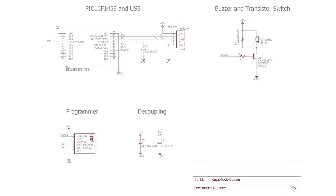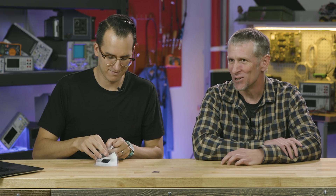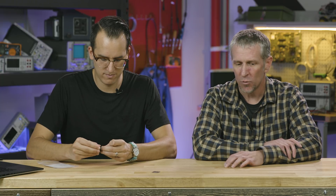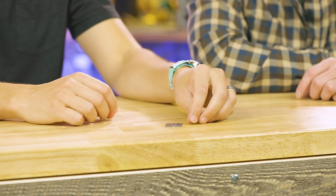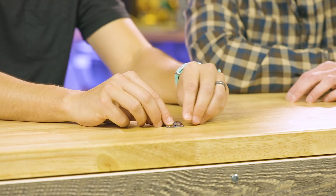On the USB connector, I don't have advanced manufacturing facilities at home, so I was looking for a surface mount USB connector because it would be small and wouldn't take up too much board space. But I also wanted alignment pins so the connector wouldn't move as I was trying to solder it with a giant soldering iron. Let's see if we can get a close-up of this.